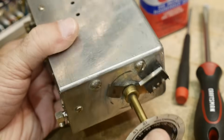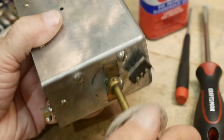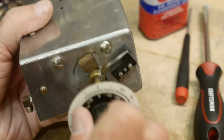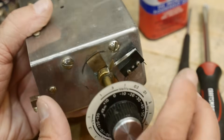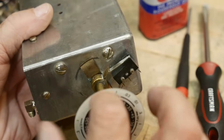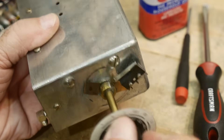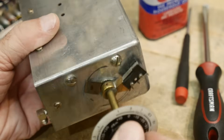As you spin it around, it also has a micro switch and a little flag that says you've gone all the way to one side — so somehow it knows you're on the last one, which is the plus 10 dBm range. Usually the way these instruments work, you can go all the way to zero dBm and then getting plus 10 dBm is actually quite tricky. So this switch probably turns on an amplifier — you're running without the amplifier, and then on the last range you've turned on an extra 10 dB amp to get you up to plus 10 dBm.